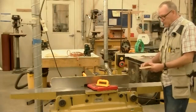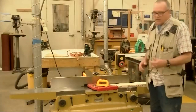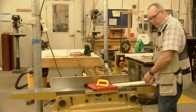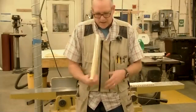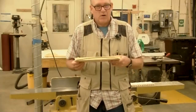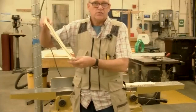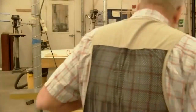We're going to go face down. These are the faces, these are the edges, these are the ends. One of the things to keep in mind when jointing the board — whether it's the face or the edge — if your board has a bow in it, you want that bow down on the jointer. You want the board touching at the ends, not in the center. If you do it the other way, the board's going to tend to rock as it goes through the jointer, and that's not going to be effective. So you want the bow down if there is a bow in the board.